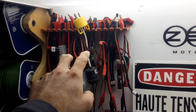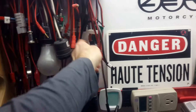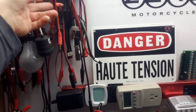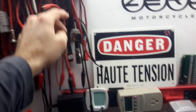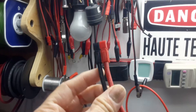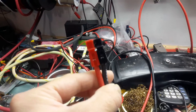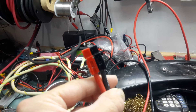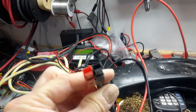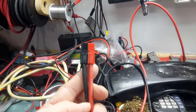As you can see, I have a lot of these adapters that I made over the years for testing various devices using many different connections, always with the Anderson PowerPole PP30 connectors. I've been using mostly 12 gauge and also 10 gauge wires. This one here is 10 gauge — you can see its size compared to the connector. I found a way to insert them without losing any strands, giving a great connection with flexibility and maximum contact. It can sustain about 40 amps continuously without dangerous overheating.